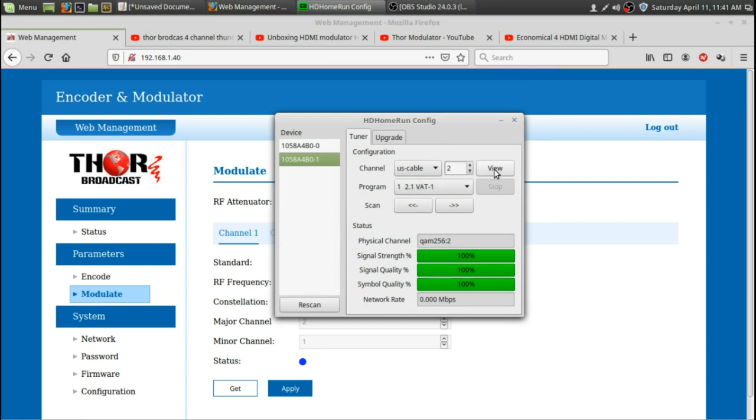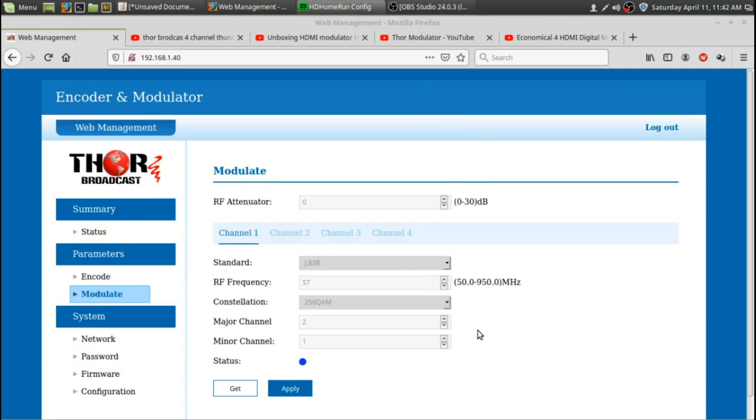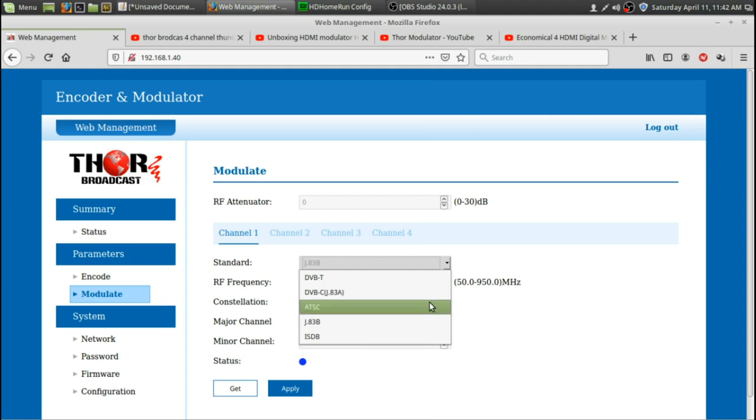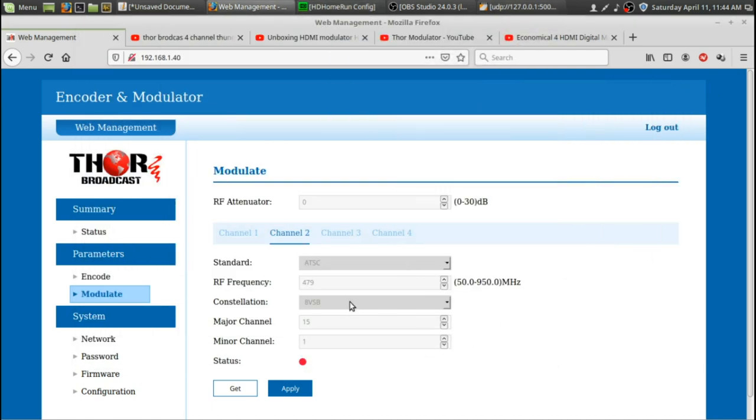There's my OpenATV — this is just my satellite receiver with its default output. I actually want it on ATSC, so I'll go with the defaults and put channel one over to ATSC. It brought it up to a UHF channel — there's my satellite receiver in port one. Interestingly, when I switched to ATSC, all the other channels switched to ATSC as well. You can't mix QAM and ATSC. By default it brought channels over to 15, 16, and 17, and I don't want to use those because there are actual channels broadcasting in my area — I'm going to combine this with my antenna.